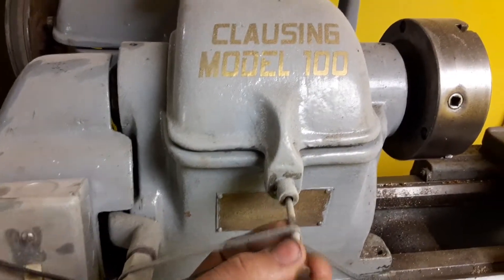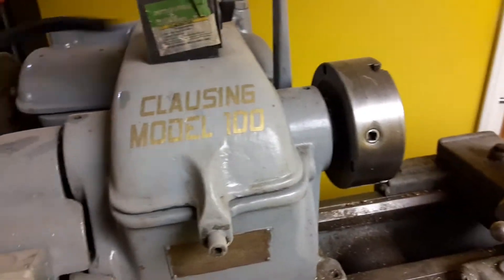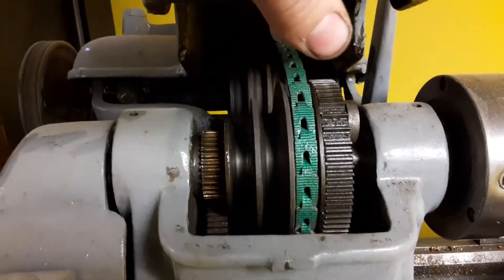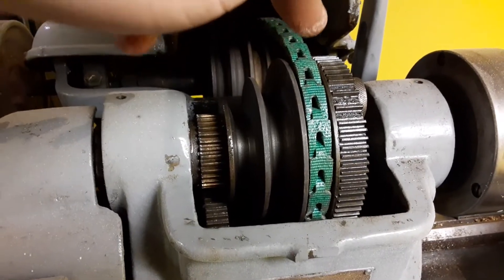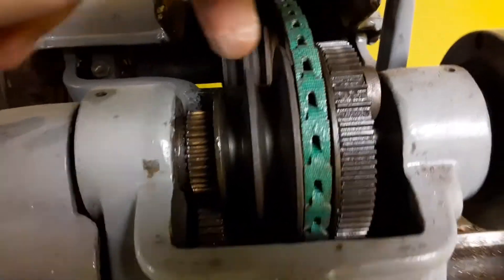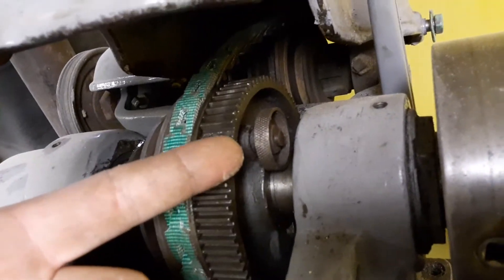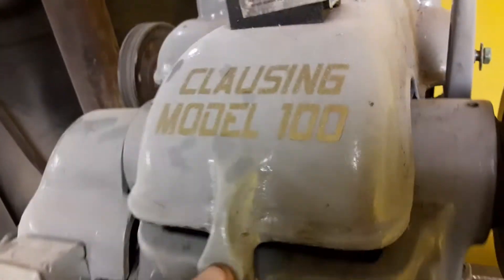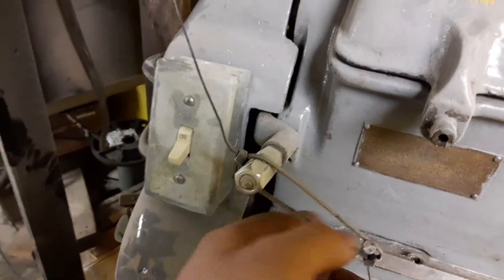It needs a pin right here so I just used a nail. It is a three-speed belt drive — you can see the threading gears and the back gears. That looks like it's got teeth broken off, and it does, but it does not affect it at all — it works fine. And that's the little clutch; it's got a friction clutch. You turn that knob and little shoes come out and contact it like a brake drum. This is to engage the thread gears.